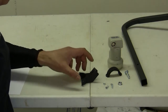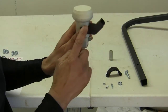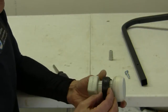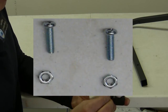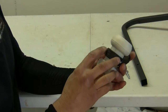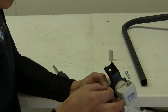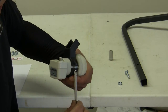On this next step, we're going to assemble the LMB bracket. Take the lower part of the LMB bracket and slip in the LMB facing the same side as the tab. Then proceed by grabbing the top portion of the bracket with the numbers facing you and place it on top. Take the small three-quarter inch Phillips screws and slip them in the holes on top. While holding the bolts with your fingers, take the corresponding nuts and slip them on the bottom of the bracket. Then take your Phillips screwdriver and tighten these down.